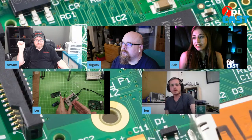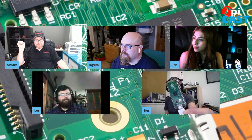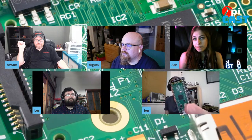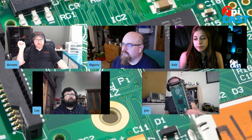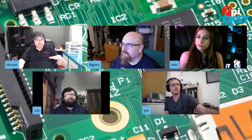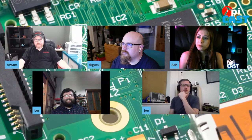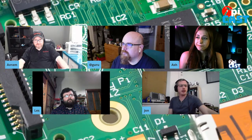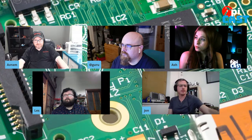There's one very good reason for doing it with the pins going down: the boot select button would be unavailable if you flip it — it would be trapped between the sandwich. I did it the opposite way simply because when I put it on the breadboard I wanted to see the GPIO markings. Due to the components on the top side, they don't have individual pin markings on that side of the silkscreen. But this is definitely the official way to orient it.